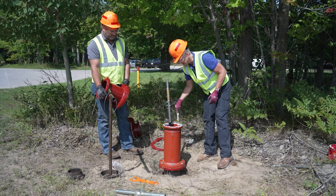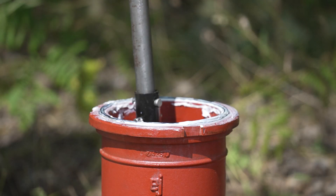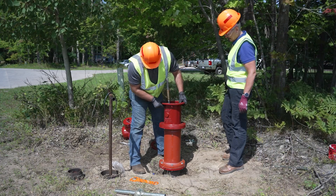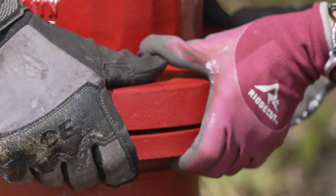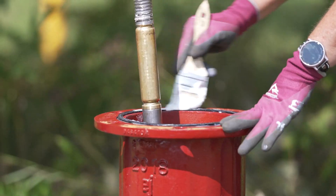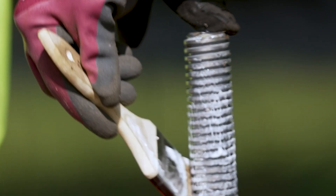Lightly grease the quad-seal ring after placing it in the groove of the standpipe. Then carefully lift the traffic standpipe onto the standpipe extension. Replace the original swivel flanges and the 6 flange bolts and nuts. Replace the bonnet quad-ring, then lightly grease. Also grease the threads on the stem.